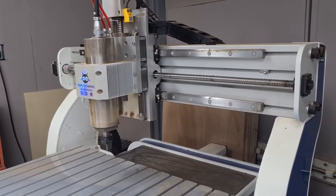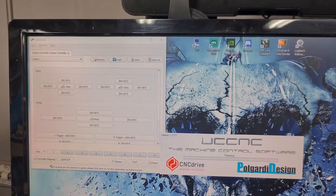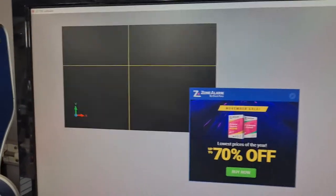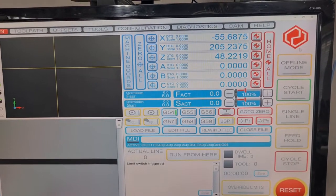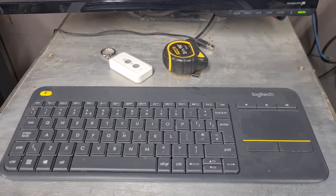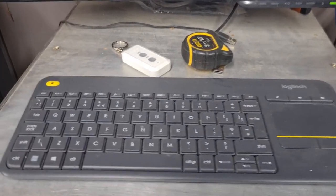Let's turn the machine on first. If you don't turn the machine on first, the software won't load up — the software has to see the machine so that it knows what the driver board is. So we start the machine up first and then we'll load up our software. It's UCCNC. Here's our UCCNC software — first thing you have to do is click Reset, and then we have to home it. I can use this wireless Logitech keyboard — this is what I normally use when I'm setting up the machine.